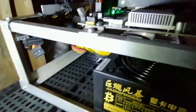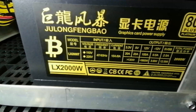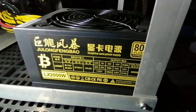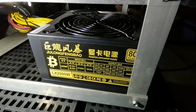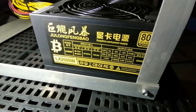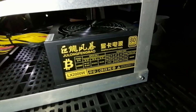I'll show you the power supply I'm using. As you can see right here, that's the brand — and that's the 2,000-watt power supply. One guy actually said it's overkill for this rig, but it's not, because 2,000 watts is the capacity of the power supply. It's not drawing the maximum 2,000 watts all the time — it depends on the load. If your load is only 800 watts, the power supply is only going to draw around 800 watts, not 2,000 watts all the time. But it's capable of handling 2,000 watts.